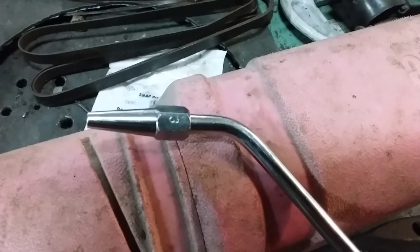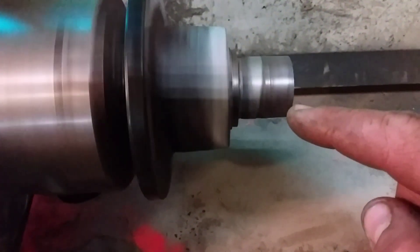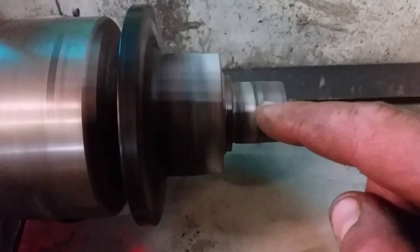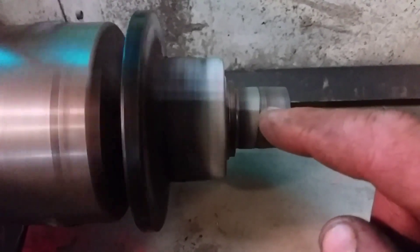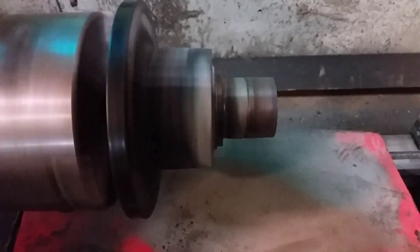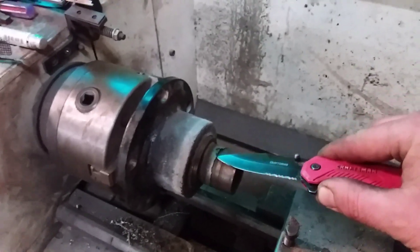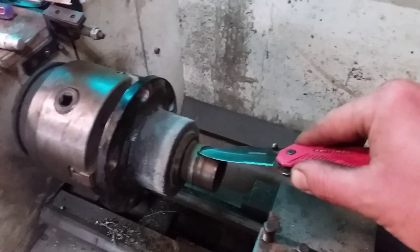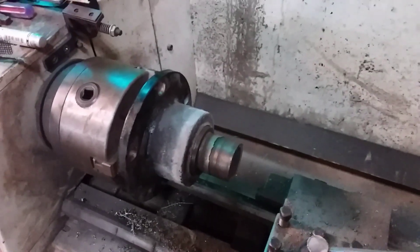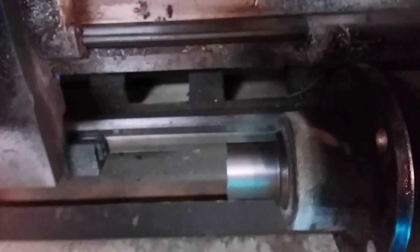We put the biggest tip on there so we can put more heat into it. I realized I was being stupid - I started to heat it and where it was previously spray welded it started glowing and nothing else did, which tells me I don't have adhesion underneath and all I'm going to do is build on crap. So I'm going to take the bit and clean it clear off like I should have from the beginning. After it's been heated you can see it just pries up - no adhesion there. I should have prepared it better. Actually just read the bottle - it says right there at the bottom: mix before using.